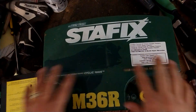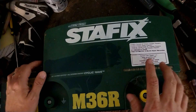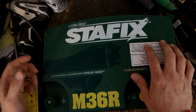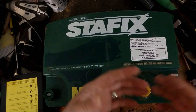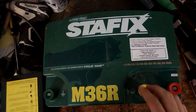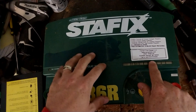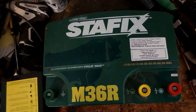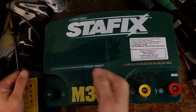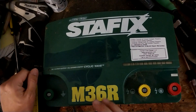This thing kind of monitors itself. There's a control circuit board inside that these lights are mounted to. That board has a lot of software, chips, and monitoring devices on it. It keeps tabs on the unit itself, keeps tabs on the fence and ground — what's being effective out there, what's shorting it out, how clean or dirty the fence is. If something goes wrong, it flashes out an error code. You can unplug it from the fence and ground, plug it from the wall, give it a couple of minutes to reset. Sometimes it works; most times it doesn't. If it starts flashing the same thing again after you plug it back in, 90% of the time something's wrong inside.